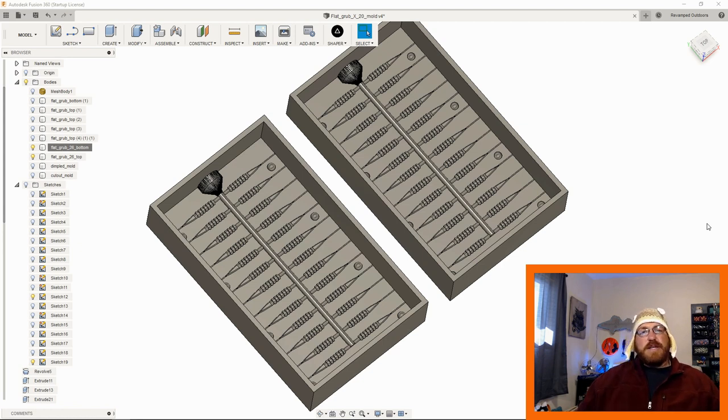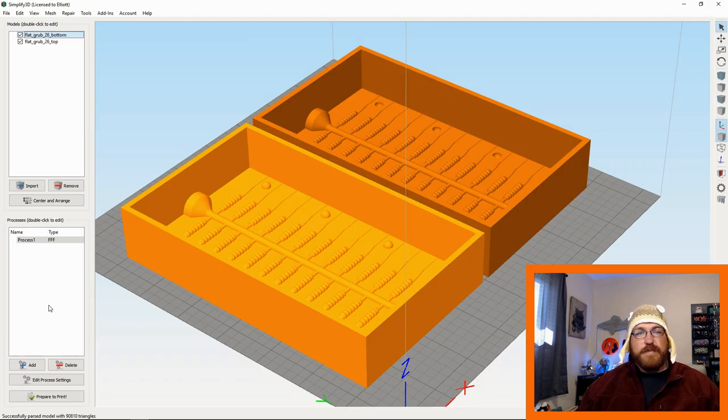So there's a few things to consider while you're doing this, setting it up for printing too. And I guess we'll jump into Simplify 3D, and I'll show you that real quick. So we're in Simplify 3D now. I found that you want the highest resolution you can, right? Because we're going to put this into silicone, then eventually inject it. The fewer layer lines, technically, the better,